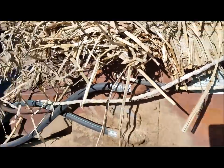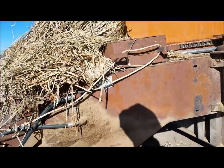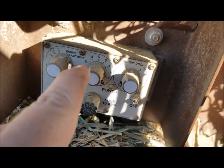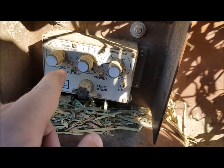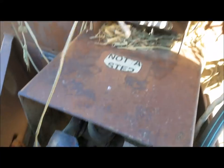This is your tub speed setting. You lock your hydraulics constant on the tractor and adjust the tub speed here — slower for wet bales, faster for dry bales. It's a 1000 PTO. This one's been upgraded with the governor sensor, so you set your engine adjustment and can fine-tune it. If you're bogging the engine down, it senses the PTO speed and stops the tub so the PTO can catch back up.